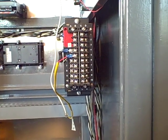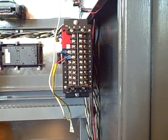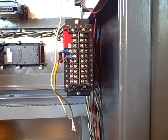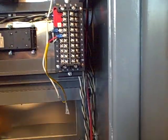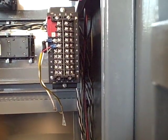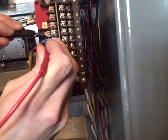Now you're reading minus 42 volts across the transmitter, which is funny. You wouldn't expect that. So let's take a voltage measurement across the cables as they land on the transmitter — that'd be B5 and A4. And what do we get for voltage? We get 27 there. Now that's a healthy voltage — correct voltage, correct polarity.